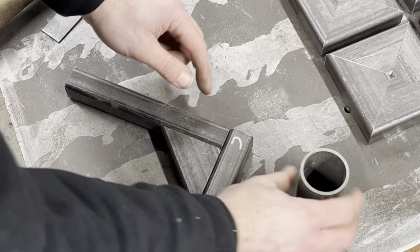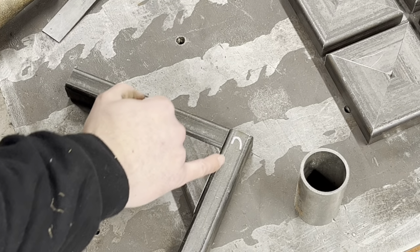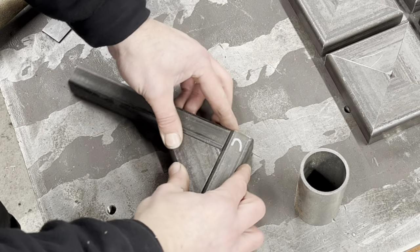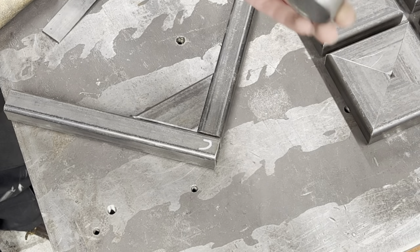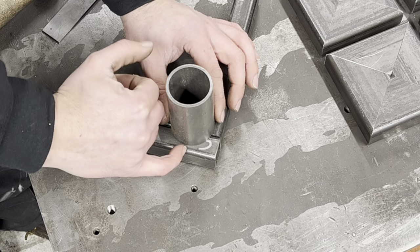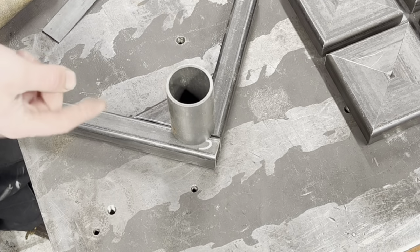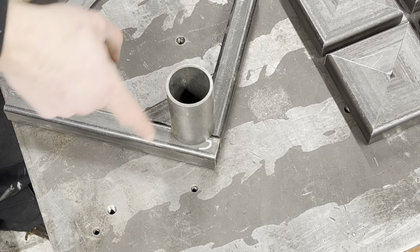So, this is welded to this all the way around. We then have a full weld here, full weld here, full weld here and here, both sides, locking this unit together. Yeah? Locking it tight. And then my 45mm tube comes down, and I'll put it about 5 to 8 mil in either side there. Then that gets fully welded, which also connects the three parts together.